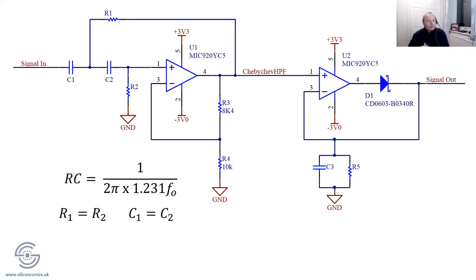One thing I will say is, if you are doing analog signal processing and then you're going to put it ultimately into the processor chip, don't forget that a lot of signal processing is going to be plus minus signals. Putting a minus signal into a microprocessor on the ADC, the analog digital conversion, it might not be very happy about it. It may clamp the signal and not work properly. So you might have to have what we call a DC offset, where rather than being, say, plus 1 volt and minus 1 volt, you just lift it up. So it could be biased at 1.5 and then go up to 2.5 and down to 0.5. That makes some sense.